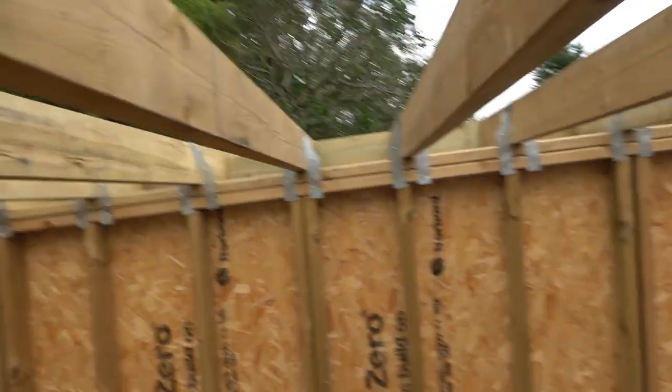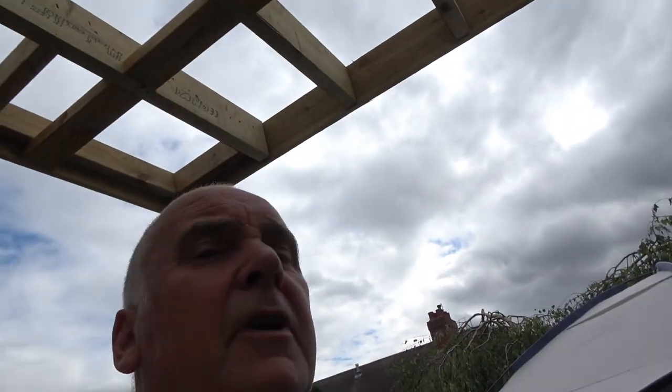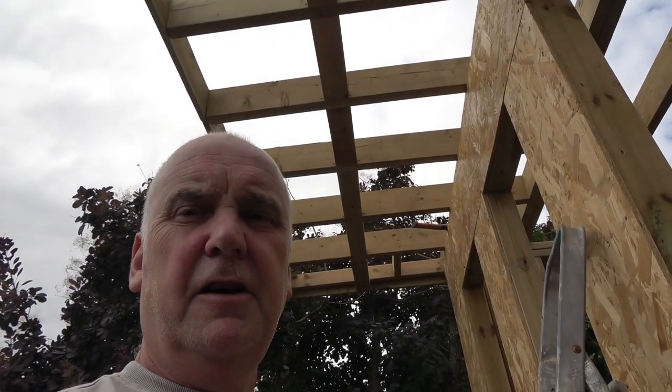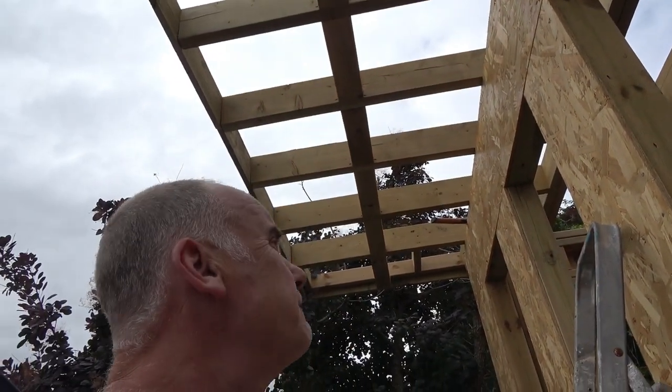Good morning. I've put the perimeter 6x1 all the way around, and I've also insulated that corner - it's all done. Up there where I put the soffit, it's a long span so it would droop, so I put a noggin board catcher in the middle.